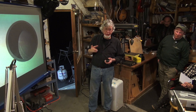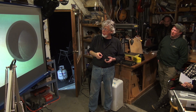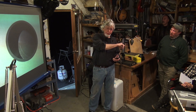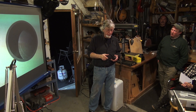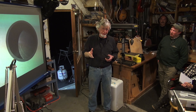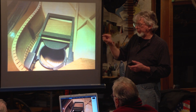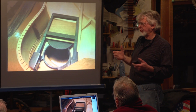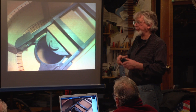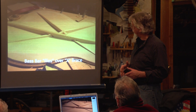It's not how I thickness tops, but people ask what makes archtop guitars really great. Well, you have to graduate the tops. We'll carve the top to maybe a uniform quarter of an inch and then I'll graduate it from maybe 180 thousandths in the center to maybe 130 around the rim, something like that. How precisely you do that makes a huge difference in the way a top works. That's the great thing about building these things.